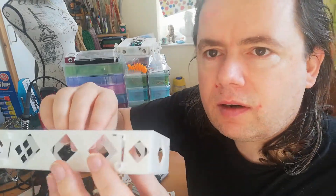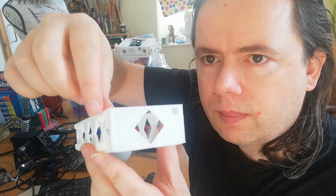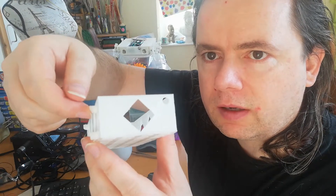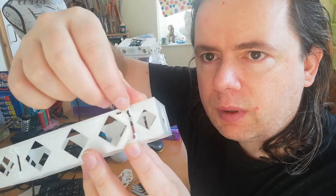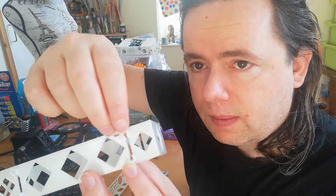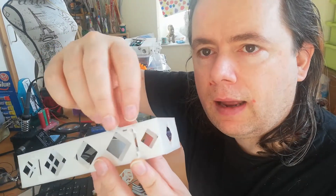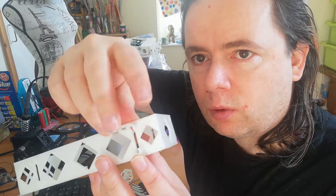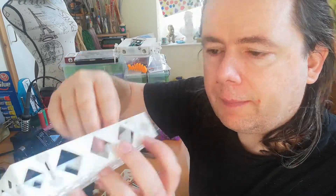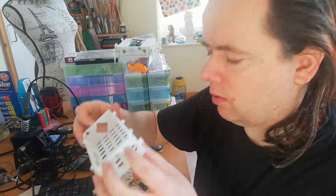On the side here I've got bolt connectors — the bolts come in here and connect onto them. The reason I put a hole here is that if the bolts are too tight, the bolt connectors will explode. You need some way of allowing stress to expand that out a bit so it grips but won't actually break.